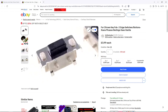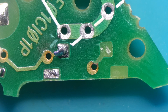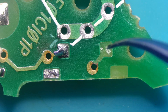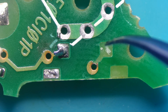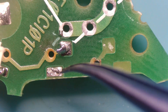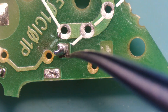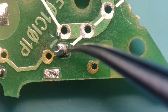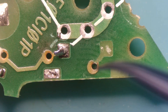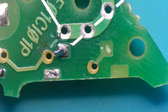This is exactly what they look like — as you can see, two anchor points on the front, two contact points on the back, and the switch is here. So I've managed to clean up the board now with some isopropyl alcohol and a brush, and now you can clearly see the extent of the damage. The trace from here has been ripped off, this is part of the switch which has remained, and we've got an anchor point here at the front. This anchor point here has also been stripped off. So now I'm going to get some solder braid, put some solder on here, remove these and clean all of these up, and get it ready to install the new switch.